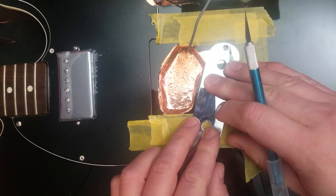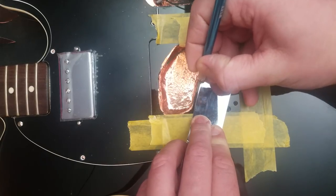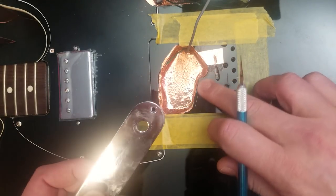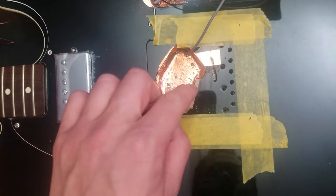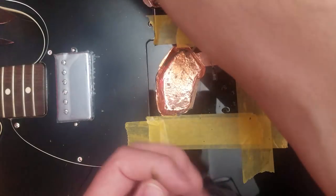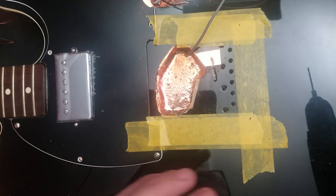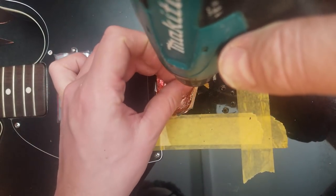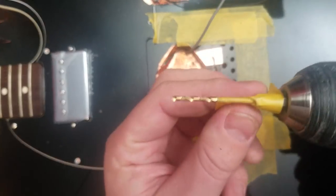So I'm going to mark off about the same distance here with my knife. I'm going to take out that area there and help chisel that wood out by using a drill to make some holes. Done a very shallow hole there just to get started. Then I'm going to take a bit of tape, put the drill bit into where I want it to get to, and mark that off — so I know not to drill further than this piece of tape.